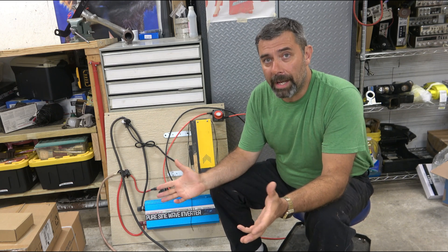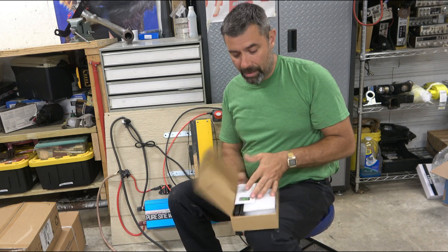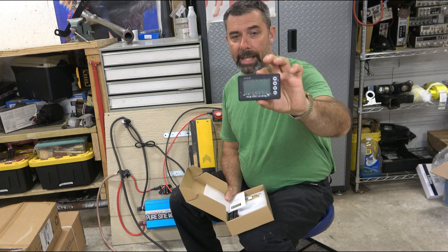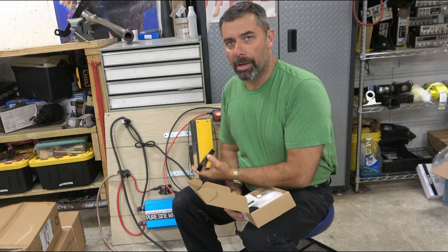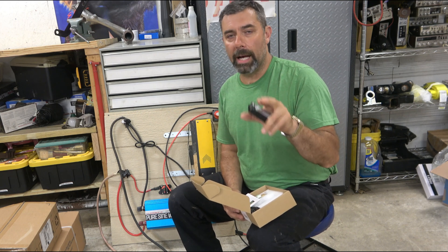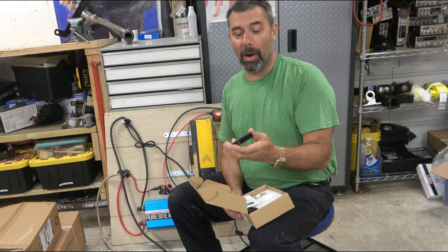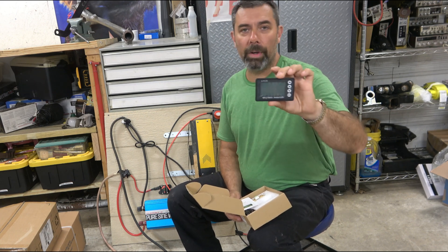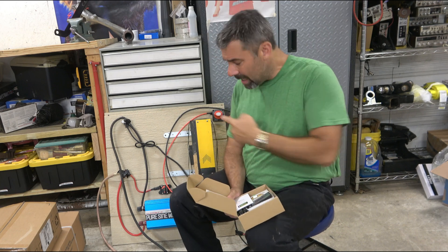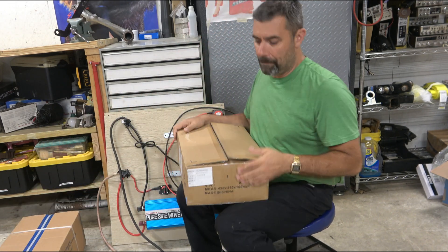I've saved up, and I'm going to be making a couple of videos on the upgrades I have planned. One piece I should have installed from the start is this battery monitor — a system monitor. I have no way of knowing the state of charge when I'm using the system. When we lost power during that outage, I didn't know how much reserve capacity was left. There's an LED on the battery that shows voltage, but that's not directly lined up with how much power is left. This monitor will show how many watts are going out of the battery, how many are coming in, and all the rest. I'm going to install it directly on this board.